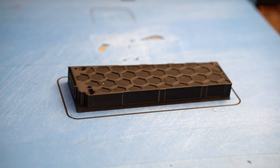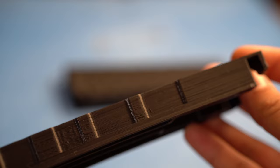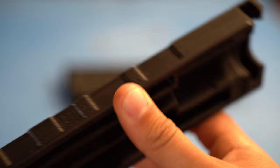And yeah, the grinding put so much dust in the air. Even though I have a cover for the spool, it kind of settled on there and it doesn't need much to clog up the printing nozzle. And this is what happened. It usually doesn't clog up completely, but you get those very, very nasty little separations in between the layers. You can see that here, and on the other side as well. You can fix that, but that is a tremendous amount of work I'm not willing to do.